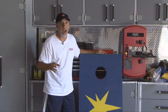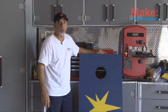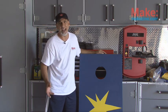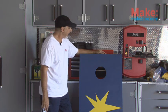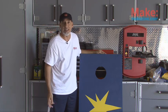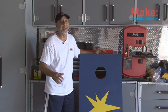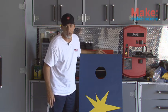There are actual regulation size cornhole boards. If you're going to play in a tournament or a league, which there are quite a few now, then you'll want to build them according to those specs — two foot by four foot in size, made out of plywood. Some commercial ones are made out of plastic, but it's much easier to make them out of plywood and that's what the majority are made out of. Then two by fours for the base of the board. There's also regulation size and materials for the cornhole bags. There's a link along with this video to the American Cornhole Association where you can get all of the dimensions for the boards, bags, and the playing field.